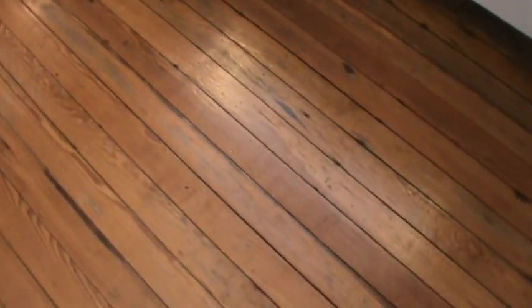And right in here, can y'all see that where my foot is? Right in there, of course it looked real white, but we've got to put another coat on just this area over in here. And first we'll have to sand it with the 220 sandpaper. But we're going to wait for several more days just to make sure everything is super dry, and then we would be finished. Yeah, so the floor looked good.